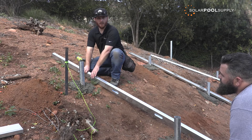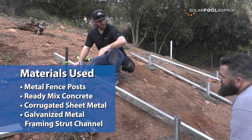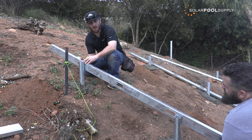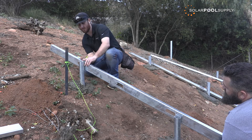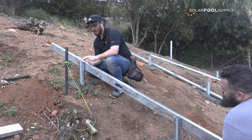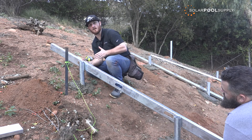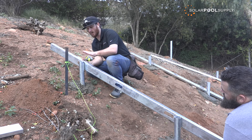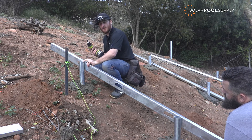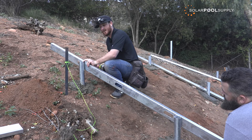When you have your posts cut, you're able to use the vertical supports, which are the main structural support of your rack. These will run vertically up and down; all the other pieces will run horizontally to support the panel. I have a mark lined up where two feet is, and I'm lining it up to the back side of this post. Since you already have the post cut, you want to make sure the center lines up exactly with this piece of metal so that when you put the other horizontal supports for the panels, you avoid any damage to your panels from rubbing. The easiest way is to use a self-tapping screw first before you bolt it in — I always recommend using a bolt because it is a lot more secure.